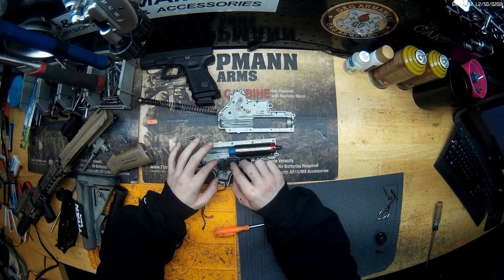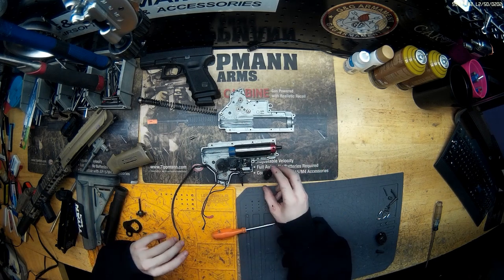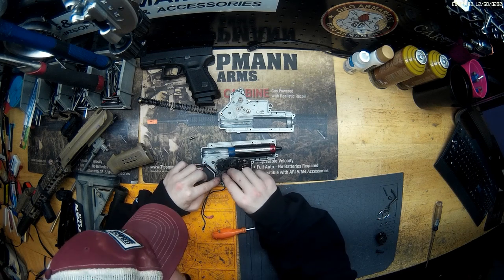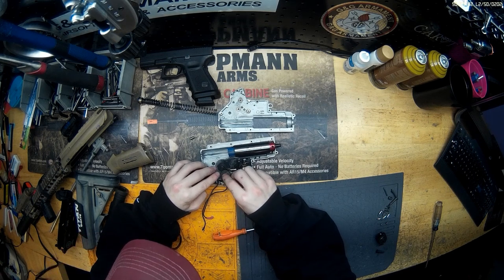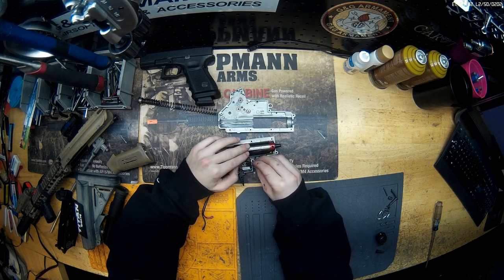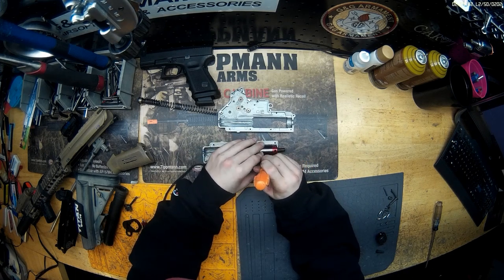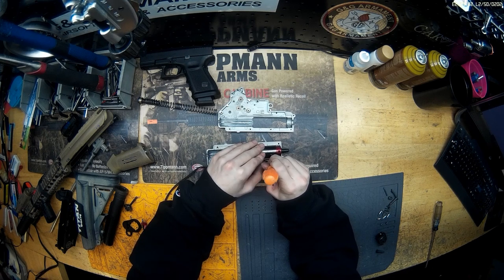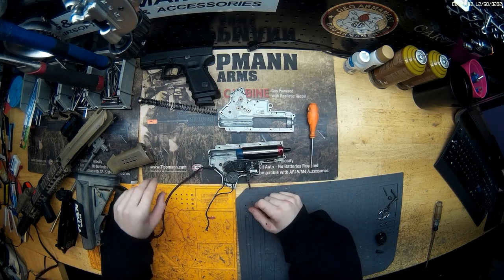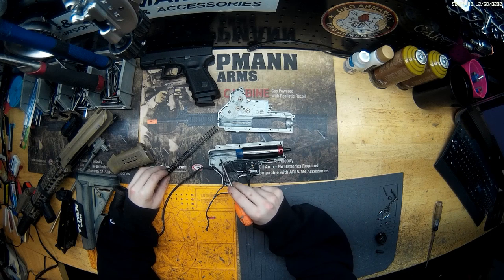You'll get an error code that says either the gear sensor is broken — which would be bad — or that it's dirty and needs to be cleaned off. Once you clean it off, it should cycle just like normal. Even if you do get too much grease, it's not a big deal — just take a paper towel and wipe it off. The second you get that stuff off the sensor, it's good. Really, those are the only error codes I've gotten with the Titan. If your shimming is fine, you don't need that much grease anyway. Just a little bit of grease on the piston rails — that's all.